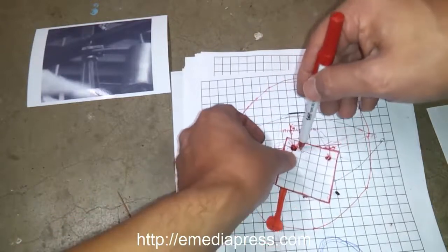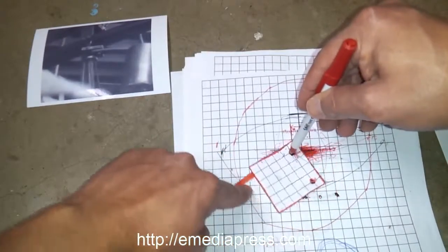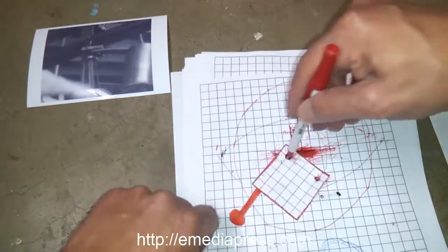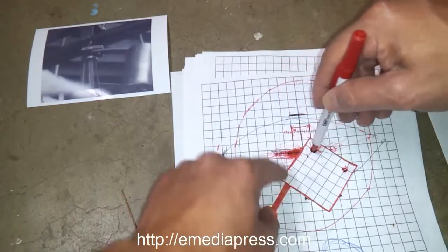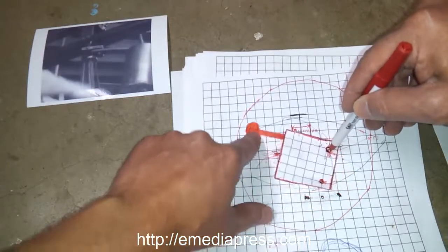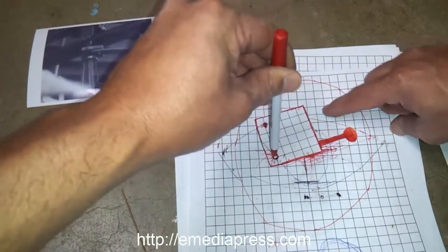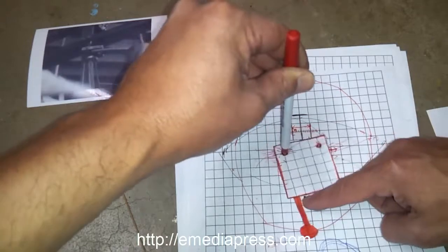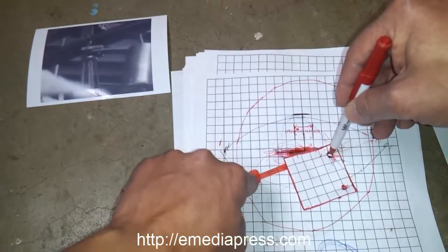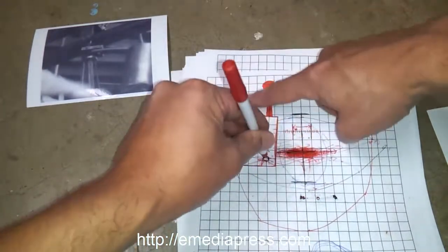So when you're going like that, you're rocking this back and forth. So the center axis that this bracket is, that this weight is revolving around right now is fixed. But with that type of motion, what you're doing is you're changing the center reference to this weight, which means when it's out here, it's going to trace out here. Okay, and when you come back this way, it's coming like that. You see what I'm saying? So the center point for which this is rotating around is constantly moving back and forth. Okay, so that's how you're getting an elliptical motion to that.